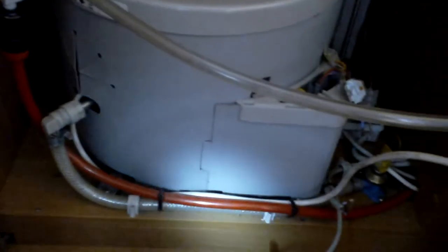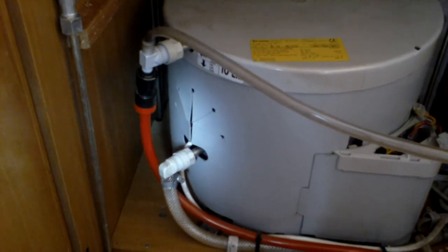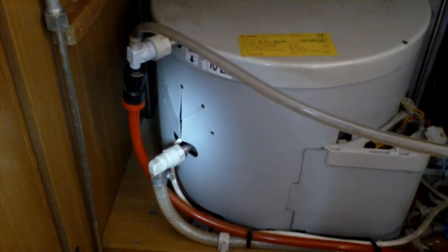Now loosen the brackets and pull the pipe off. I've got to do the pipe clips down the bottom. I think I'll do the pipes where they connect onto the unit first, and then after that do the screws that hold the feet down - you can see them just through there. There must be about three of those, with another one around the back somewhere. And then after that it's the gas connection, and that should make the thing move - we will see.